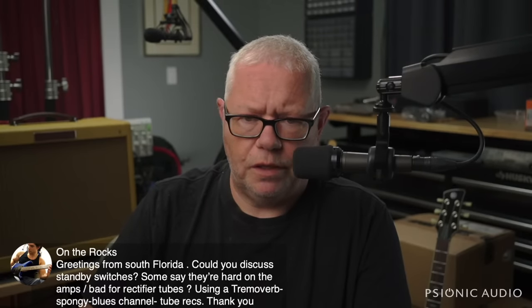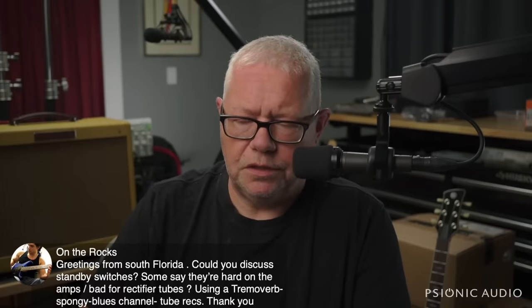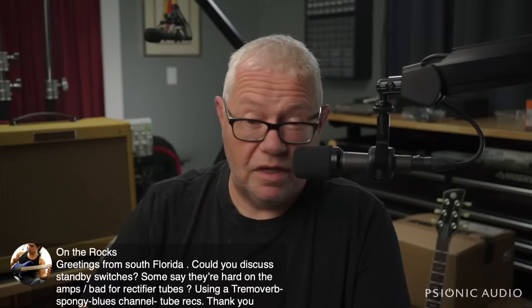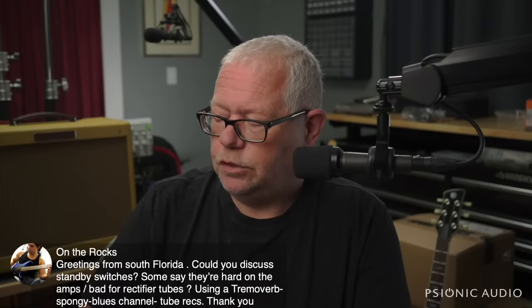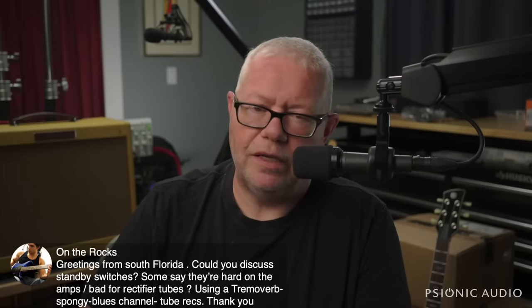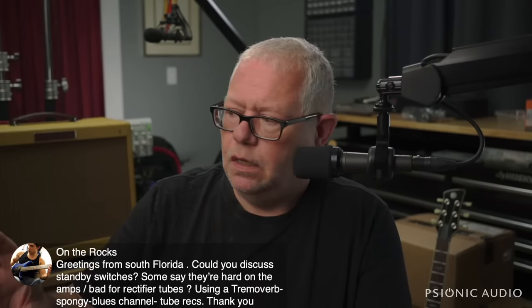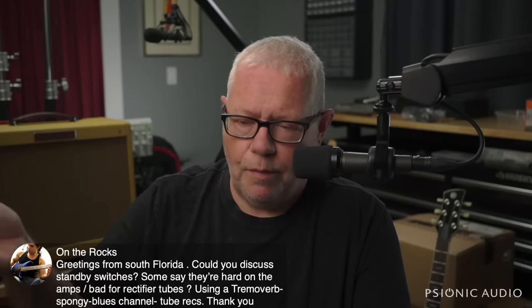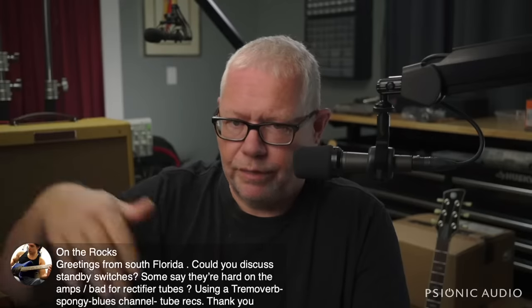There's another video I have on my channel, Does This Amp Need Standby? If you have a solid-state rectifier, you probably do need to use standby. If you have an amp which has a cathode follower, it can be beneficial to use standby. If you have an amp that does not have a cathode follower, that has a tube rectifier, you will rarely need to use standby unless some numbskull accountant put in 350-volt caps, and when the B-plus isn't loaded by the output tubes working, the voltage exceeds that capacitor rating.